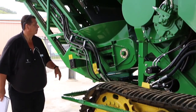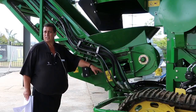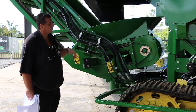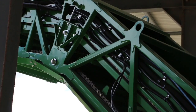Stop me if I'm going too fast — put your hand up and ask, that's fine. Next we'll move into the pivot point on your elevator. In here there's actually nine areas that need grease, so every 25 hours it's vitally important that you keep the grease up to these. They're down low and get into a lot of dirt, and if they're dry they'll start wearing your pivot pin and all your joints in there — then maintenance will become a major issue. On the elevator you'll also see there are points along here that need greasing. Up there in particular you'll see like a little shock absorber where the motor comes out and the two hoses go up — that's actually to keep tension on your elevator chain.